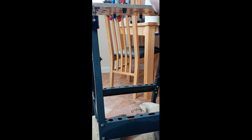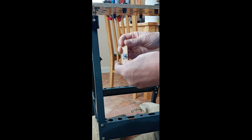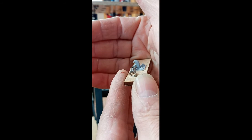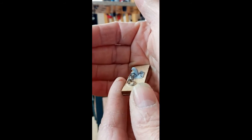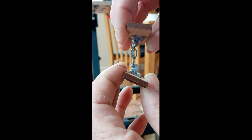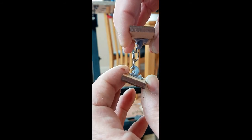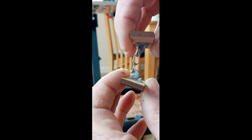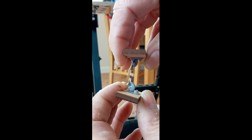I think we've found the breaking point. The top coupling is in one piece, and what's happened is the actual end of the hook has gone — it broke roughly between 8 and 10 kilograms. That's the actual angle we were pulling at, so that's a fair old weight. I think I've found the correct design and I'm using the correct polymer to give me the tensile strength I need.